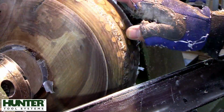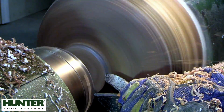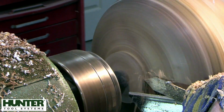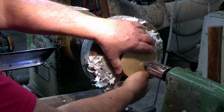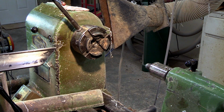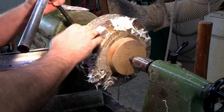If there was a way of doing these castings where you're just pouring in the band area, maybe the ideal way to do this is to do a pour, essentially like a band, and then sandwich that between the two castings. That may be a way around it, but one of those castings did have that void in it, so then you have to deal with that as well.